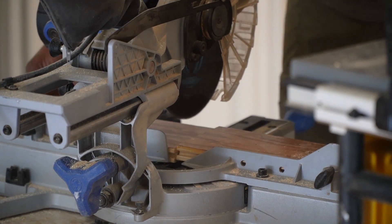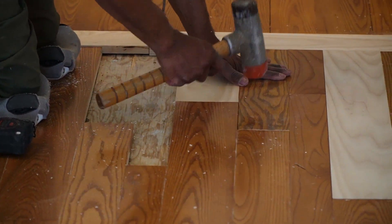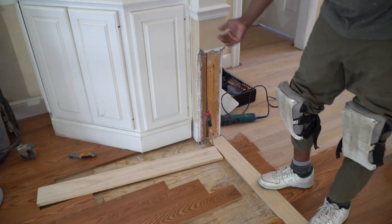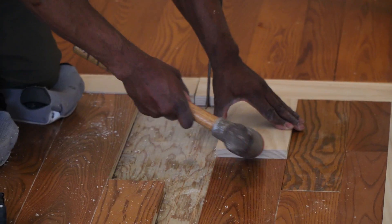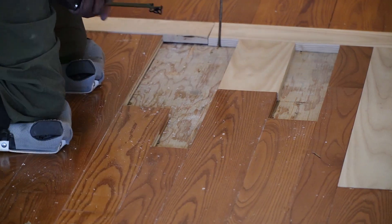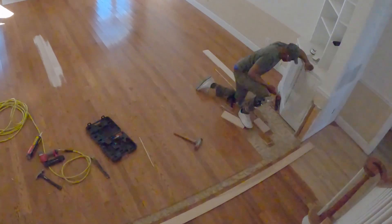Basically each piece has to be milled — that's what we're actually doing, milling each piece. And then same thing on this side. The client took out a half wall here where you can see that they took it out, extended to about right here, and then there was a void where there's missing flooring. So what we decided to do is nest it all back, weave it all in, so that when we sand and refinish it, it looks natural.